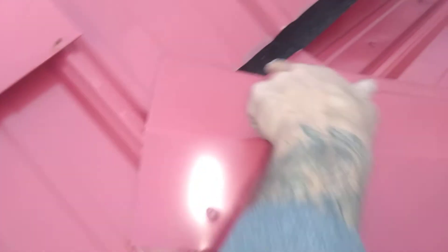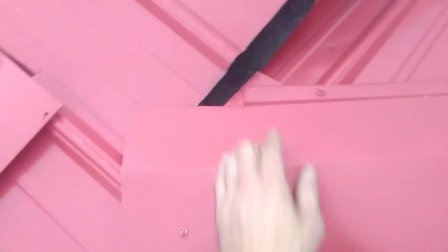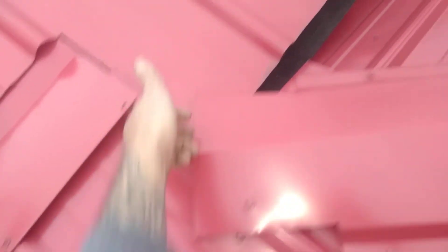The top of the metal up here — if you notice when water comes down, it goes underneath this hole and underneath this metal, which puts it right back on top of this roof. We have metal showing right here, shingles showing here. This should be tucked underneath this piece to keep water from coming down underneath, and on this side as well we have shingles up underneath.